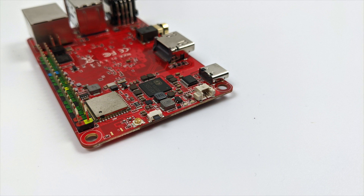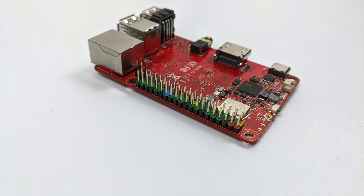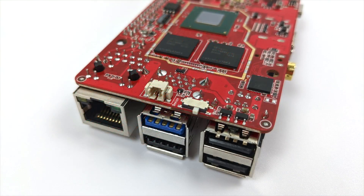On the back end, we have a status and a power LED plus the power key and an external power key adapter. So if you want to add an external power key, it's just a two wire button and it will work with this unit. The RockPi X has Wi-Fi and Bluetooth built in — Bluetooth 4.0 and 802.11ac Wi-Fi — and it comes with an external antenna. It has a GPIO layout just like the Raspberry Pi 4, 40 pins, plus a display connector, a micro SD card reader, and a spot for an RTC battery.